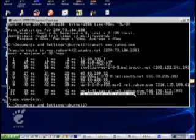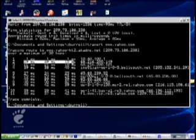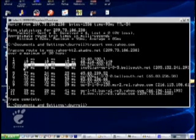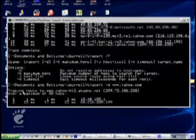And you see our original IP address that we got when we did our ping. Number two, you can see the times for each individual hop. This is important, highly informational, and very useful if you're troubleshooting network connectivity and you want to look at any one particular network node. If you're not interested in all the pretty name resolution, you can do a -D, which allows traceroute to work really fast and bypass resolving IP addresses to host names. In other words, you drop name resolution.